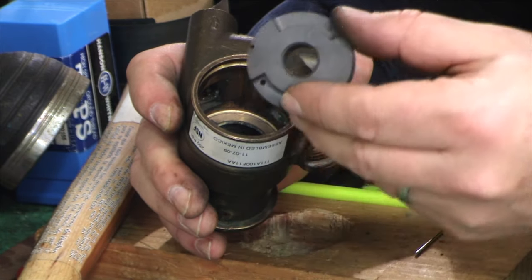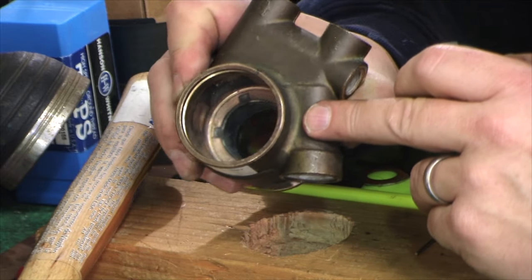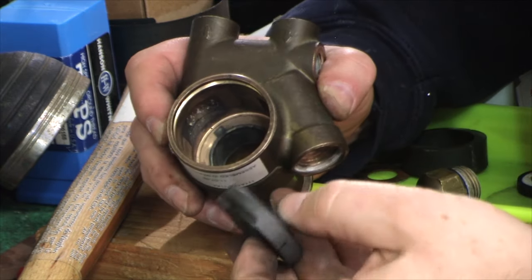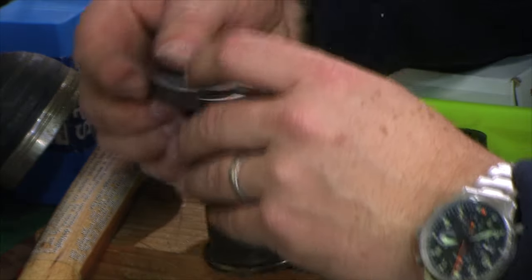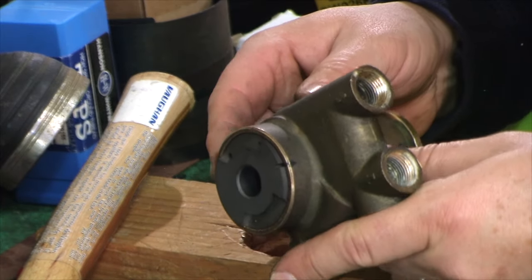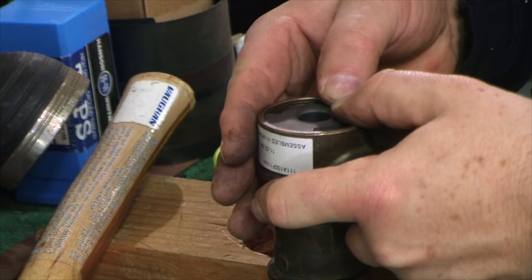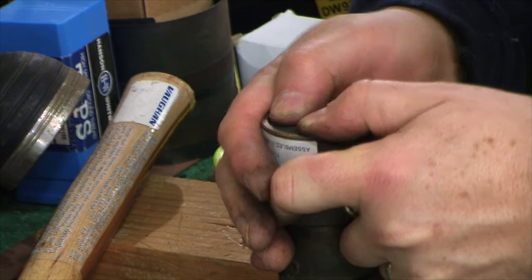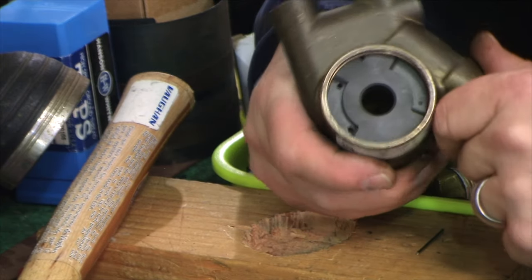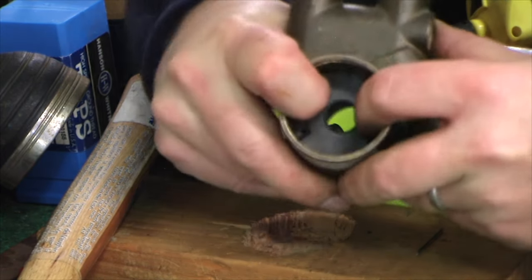The larger cutouts are facing in. If you look inside your pump, you can almost see the wear points where water has discolored it — those two marks are going to be exactly aligned with the two cutouts. I basically align the marks and the groove of where that pin is. This is where you've got to be careful because if you break this part, you're in for a new kit.